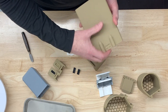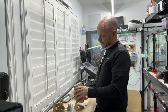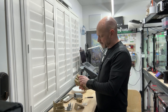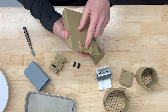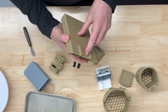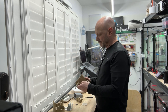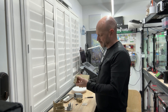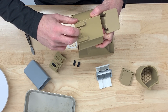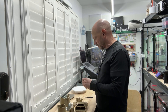The interface on the back for the accessory — this core part that allows it to engage — can be printed inverted or upright. If printing inverted, you can print it without support. If printing upright, there's a little piece of support that sits in here to get the edges of the teeth nice and clean, since there's a flat on the bottom side. If you get burrs on those teeth, it can impede the ability to lock into place, so if your accessory is moving around and not locking, clean up those little teeth and remove any loose plastic, then try again.